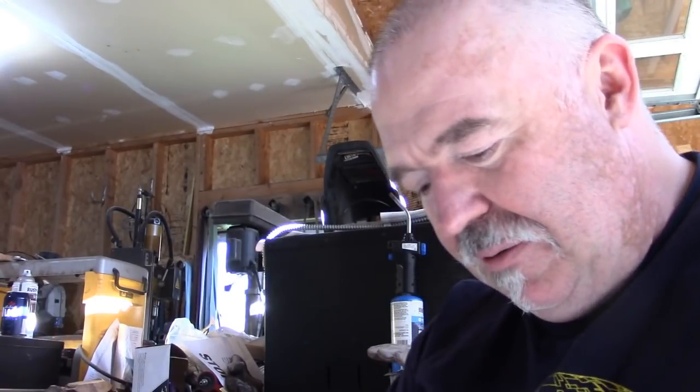You don't need to see me button this all up — it's just putting the cover back on. For the foot pedal, I still haven't figured anything out, so I'll probably just tie a wire around it and put a loop at the end I can stick my foot in. The next video will be fabricating the dies and finishing the top end, then we start testing. One of the first tests will be forging a Damascus billet by hand versus with the press — same layer count, maybe an inch and a half thick, to see if the press can handle it and how much faster it is. Everybody that says six-ton pressure will never work might be surprised.